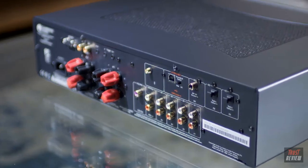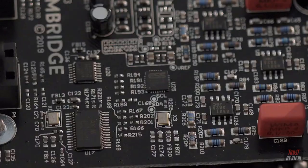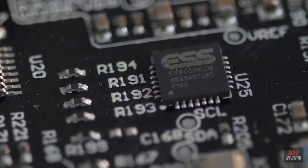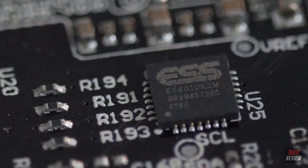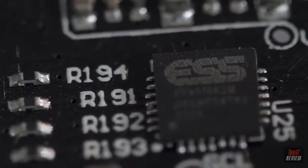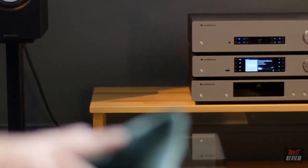The first step was to completely overhaul the digital input stage. CX amplifiers have always been designed to be equally adept with both digital and analog sources, but the quality of performance from digital sources is always improving. Our engineers specified ESS Sabre DACs because of their support for higher resolution digital files, their incredible precision and their super low jitter. The CXA61 features the ES9010K2M DAC and the CXA81 has the ES9016K2M chip, so digital information coming into these amps is precise, accurate and perfectly organized.